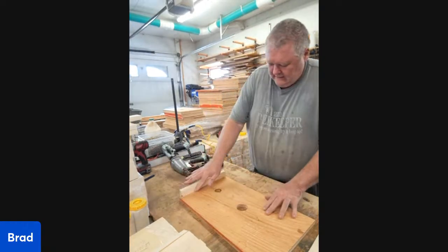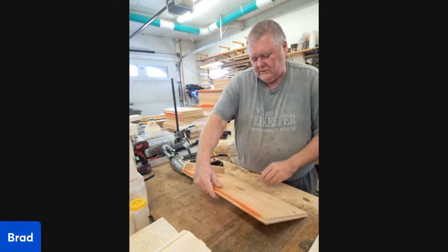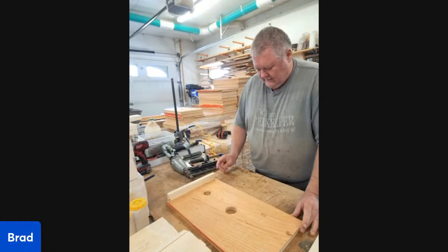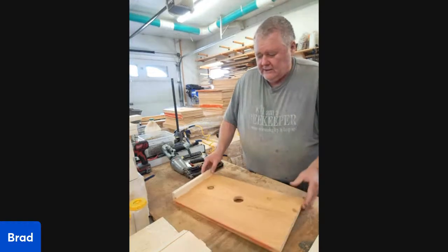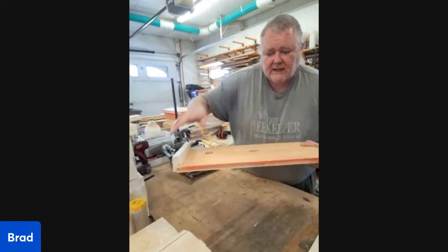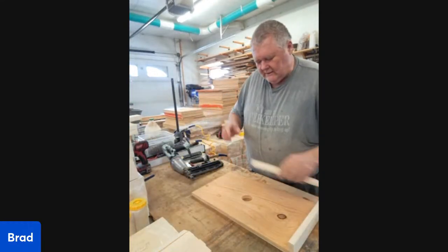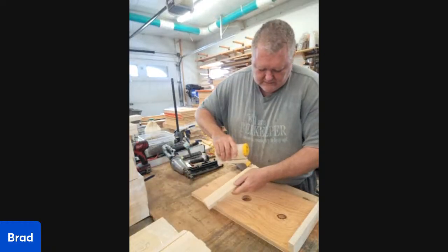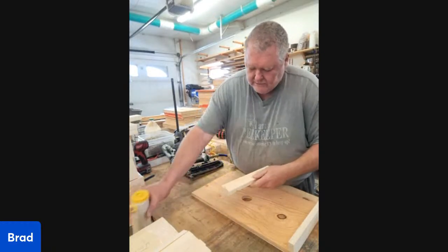It's actually pretty quiet, your nailer there. Yeah, it's not too bad. And so I'm flushing that end cleat up to this side here, and you can see that it's not flush there, but that's the trim side. That's by design. I want that to be a little bit long, and do the other one, right? It's all about trimming it up at the end.